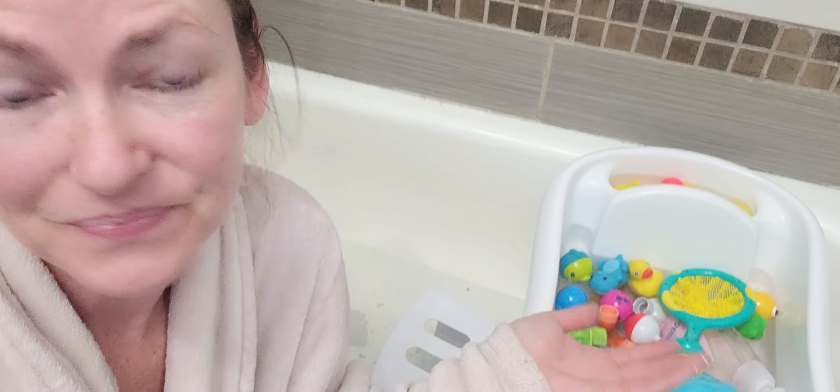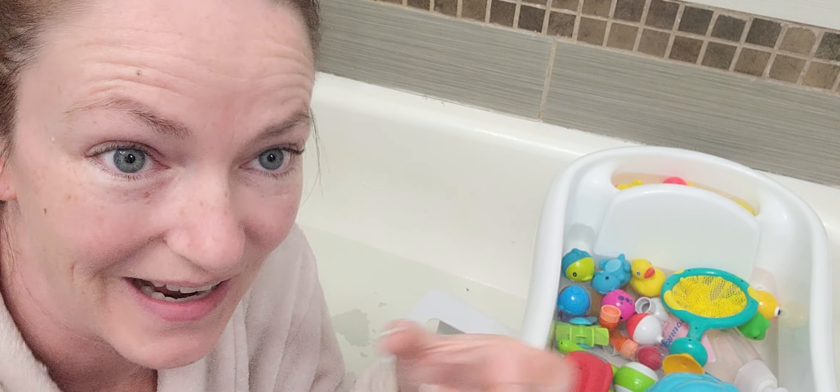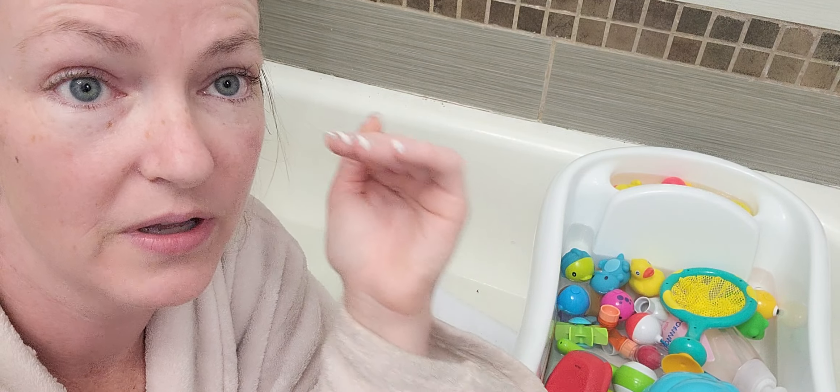That's what you have to do in life sometimes — you've got to get dirty and have gross things happen. So this is how you unclog a tub. If it's a bathroom sink and you have a vent like a little hole on the side, you're going to cover that with a washcloth and use a plunger on that. If it's a kitchen sink with double drains, you're going to cover one, or if you have two plungers, plunge both of them. That's all it takes. Make sure the water is above the plunger at all times, because otherwise you're not going to be doing anything. Like and subscribe — I'll see you next time, bye!